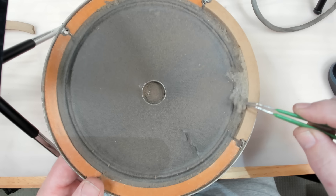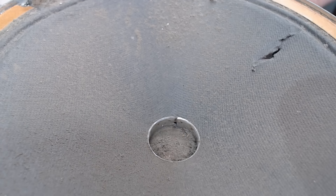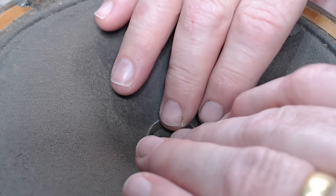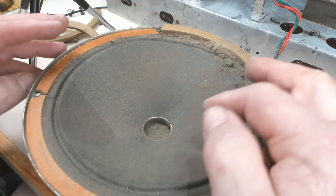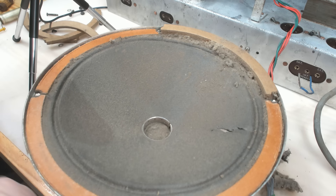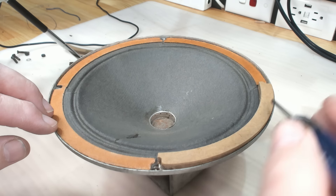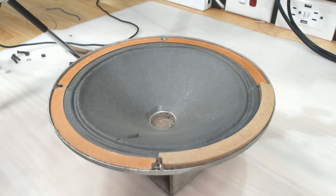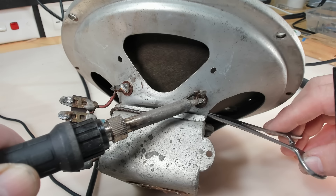Once I've done that we'll have a look at the speaker and put some power on. I've taken the speaker out and, as with all speakers mounted facing upwards, it's just filled up with dirt — a lot of dust. The worst thing is the magnet and voice coil are exposed and they've got a layer of dust. There's no little felt filter in there. It's rubbing because it's full of junk. It's also got a tear there. I'll take it outside and dust it out.